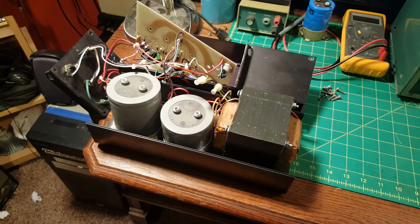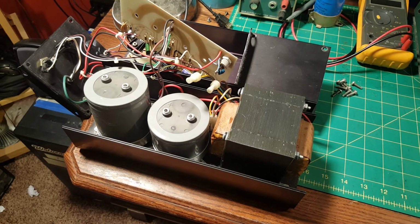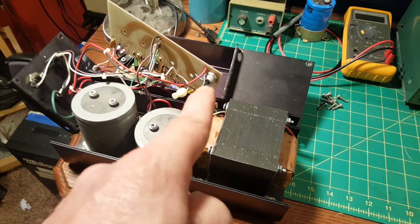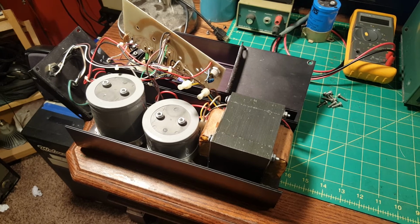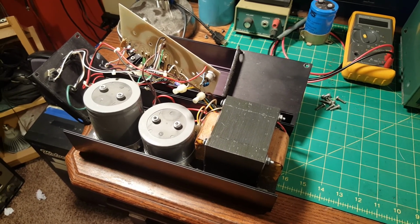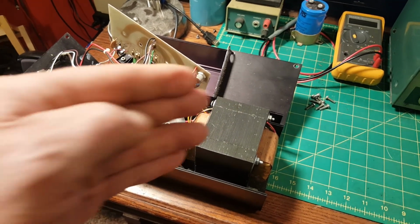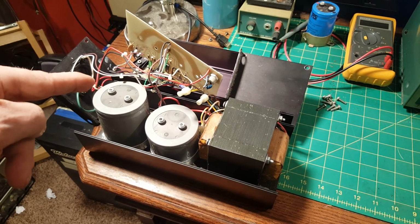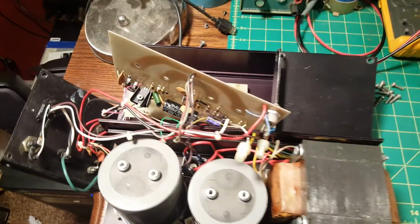In my opinion, it's far better and safer to crowbar the output right at the output terminals. Mount the SCR on the output terminals. And surely when that device triggers and those output terminals short, your rig voltage goes to 0, and right now, whilst chaos happens in the power supply, you let your fuse take care of the chaos. I hope that makes sense.